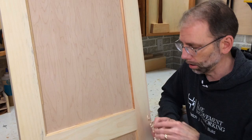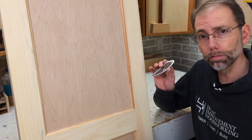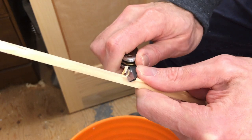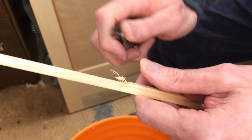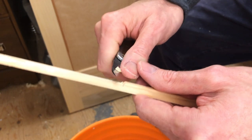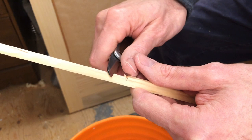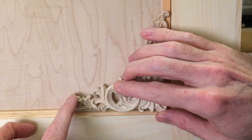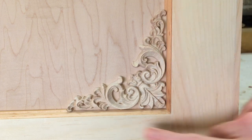I've got some nice straight lines here and here, but I still have an area at the end to let this in. The only way to deal with that is to cut it by hand, so I'm pulling out my carving knife. I just cut this back a little bit, work my way back to that line, then come back this way gently and clear out the chips. I make sure I don't have a lip anywhere up here. Then I put it in place, make sure it fits — nice snug fit.